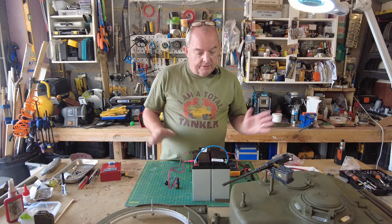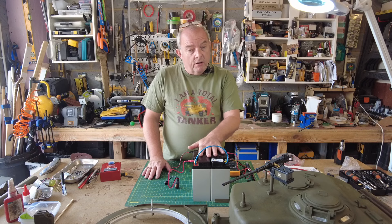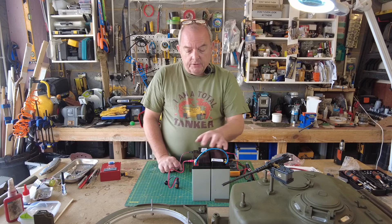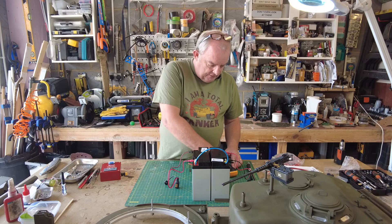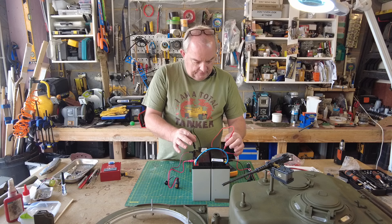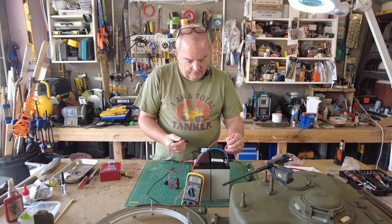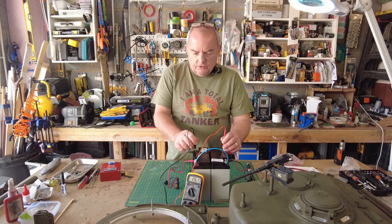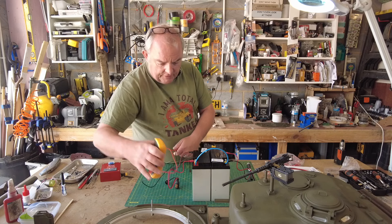Today I'm going to test the electronics. The first thing I've done is connected my two batteries — I've charged and conditioned them with my CTEK chargers — and connected them in series, negative to positive, giving me 24 volts. Let me double-check that on my test meter. Live to negative — it's running at 26 volts, so just over 12 volts each, which is exactly how you want it.